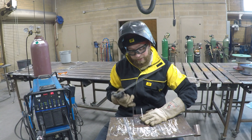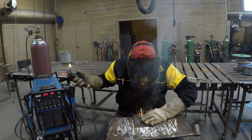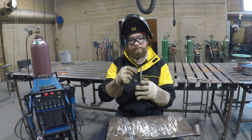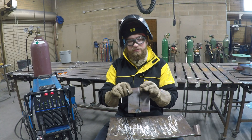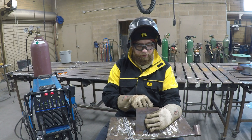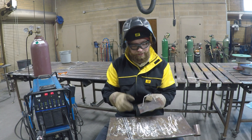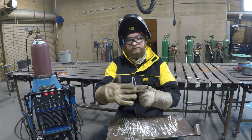If the person before you doesn't grind their table, this process is really difficult. We just put a slight tack there. Now I can raise the plate up off the table and wiggle the electrode out — it should just barely slide through. Then I'm going to adjust the other side of the plate, pulling it apart just ever so slightly. That tack is just holding it together briefly. I'll check this end to make sure the electrode fits and slides in. I'll leave the electrode hanging out and make sure the plates are still flush — I can pinch them one way or another to get them level to each other.